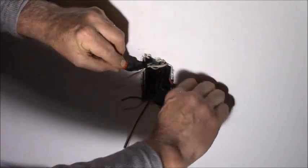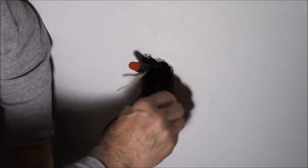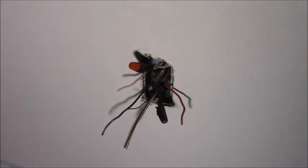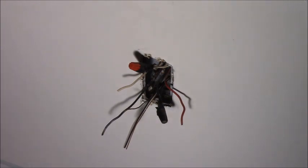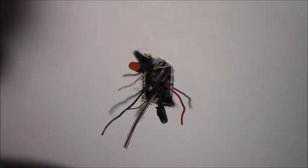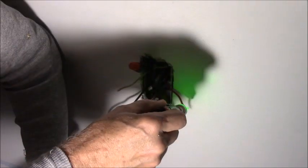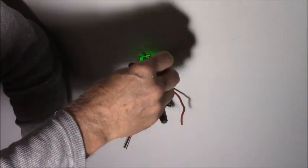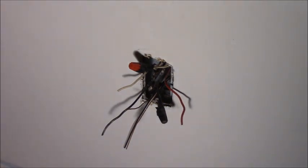So I guess this guy just stays left alone, but I'm going to go turn his circuit off. I'll be right back. I can prove to you that it's probably still hot. I got my little sniffer here. When I get next to a hot wire, the one I'm working on isn't hot. But when I get close to that one, it is. So I'm gonna go turn that one off. I'll be right back. I'm getting too old with this crap, guys.